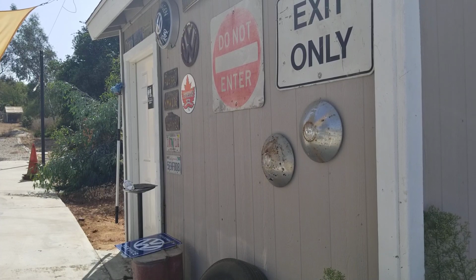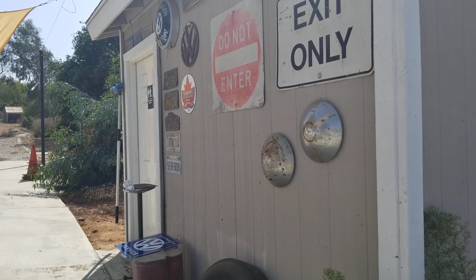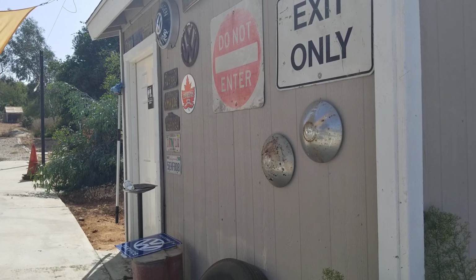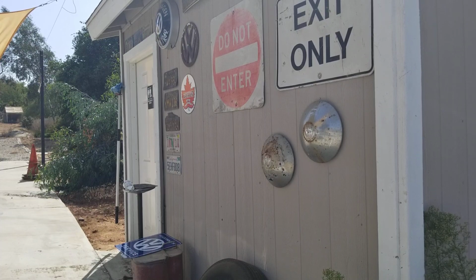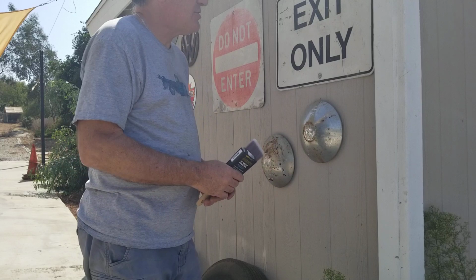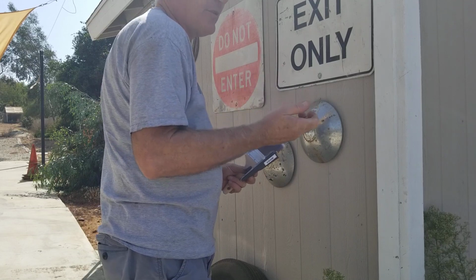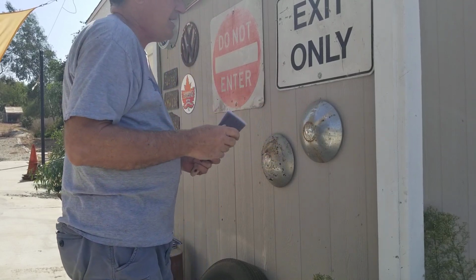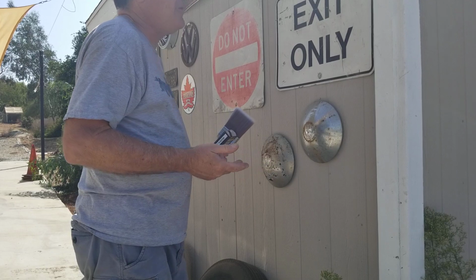But with water-based paint, it's not always the best. It doesn't really make that much difference, especially with some of the water-based enamels. Now this depends on a couple of things. You could get into a dark color, and if it has a lot of tint in it, sometimes it'll be better if you cut in first, because around the edges of your work you're going to have a difference in color. By the time it dries, the tint will roll over inside the paint, and it will give you some issues.